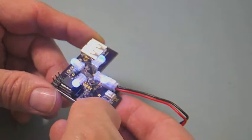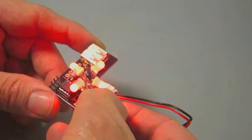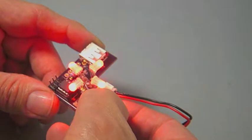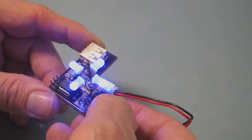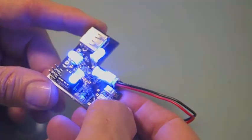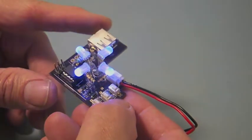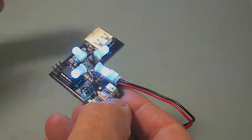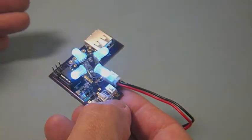Playing with the capacitance sensor is kind of annoying, and I really don't recommend you do it unless your holocron is not behaving. If you change the way the capacitance sensor is set up, or you have, like I do, very low body capacitance, you may need to manipulate it until the talk animation triggers. There we go, there's the talk animation.